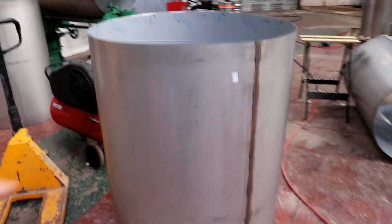So I swapped the chill bar to the backside of this, just to protect the internal weld, which it has done. It doesn't seem to have melted through. And I went in and I re-flowed all of this seam. Let's see if we can get some good light on this. I'm really, really pleased with this. Does that look good? Full penetration, inside and out. Wow.